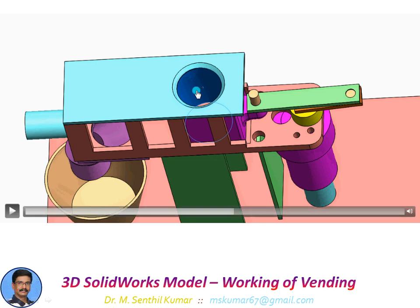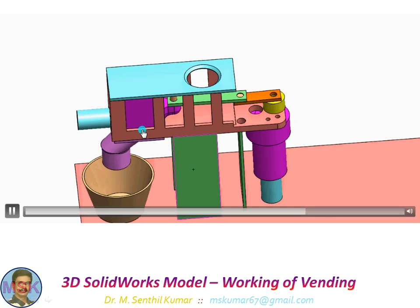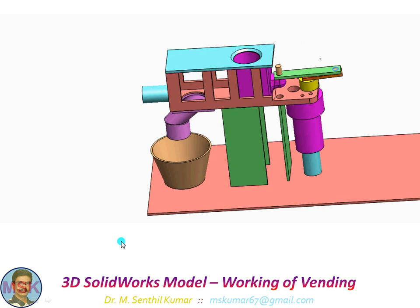Based on that, I designed this cube with a cylindrical cavity whose volume is equal to 65 centimeter cube. The hopper feeds peanuts, so the cube collects peanut quantity equal to 65 centimeter cube, worth 10 rupees. The moment you insert a 10 rupee coin, the motor starts rotating. This motor moves the cube from the right extreme position to the left extreme position. Once the coin is inserted and it goes to the left extreme position, there is a hole through which the fried peanut will be dispensed. This is the logical setup, based on which I developed this particular prototype.